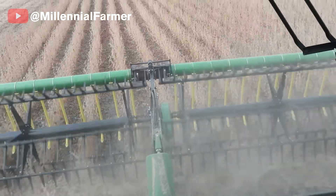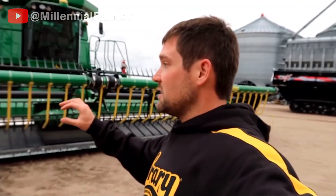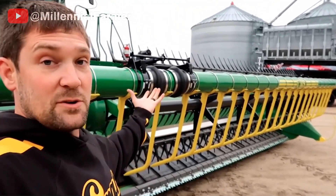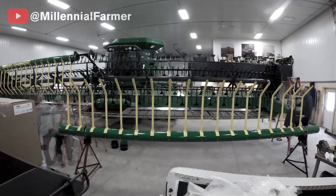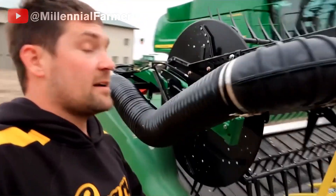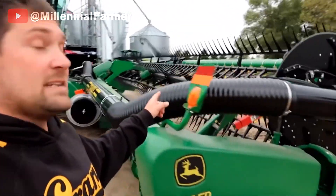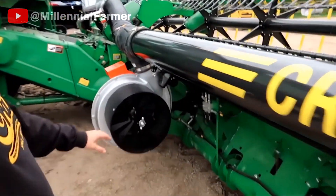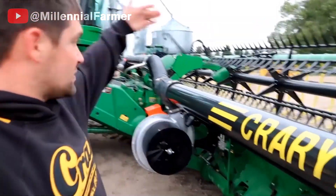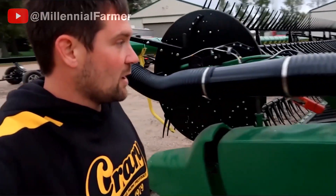The header's doing a pretty dang good job — we're not leaving many behind. What this is is an air system that blows air through these yellow tubes to help blow those in. This is all aluminum with all these tubes on here. We just use two guys, one on each end, for each of these tubes to lift it up in there, so they're not very heavy. We definitely don't need any counterweight. The air comes through the tubes on the side here, down the back. This is actually driven off the feeder house of the combine — this centrifugal fan blows the air up through there and distributes it out through the head. It goes up and down and around — all good things.